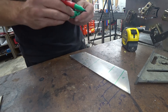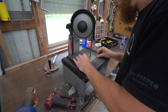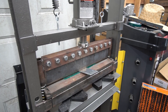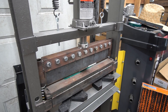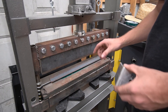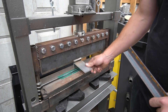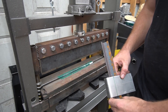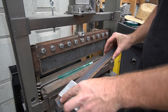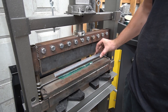Cut lines, bend lines. We need to do some compound bends — bend this now back up. But if we try to set it in the brake, we're just going to flatten it out. So we're going to make a little V-mount die essentially, to allow us to do multi-directional bends. We're going to shorten the angle iron and basically build legs to shift it up.